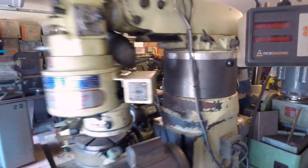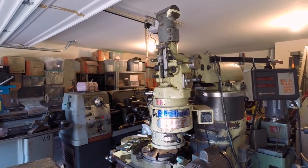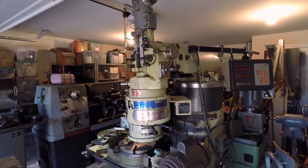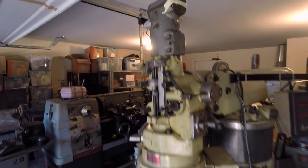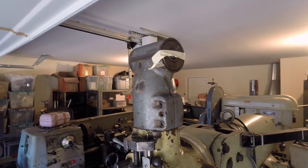You've seen the milling machine — I don't know if you've ever seen the head on a milling machine upside down like that before. It's the best way to move them; it lowers the center of gravity and makes it easier to lift. On the top you can see I've got a great little 90-degree head. Really looking forward to using that.